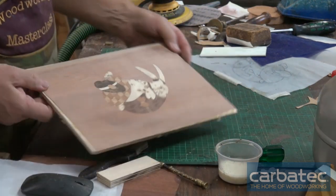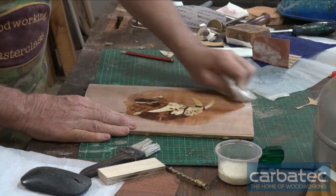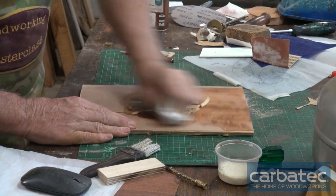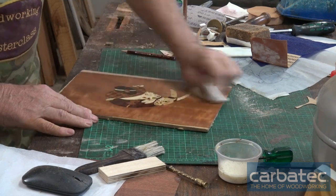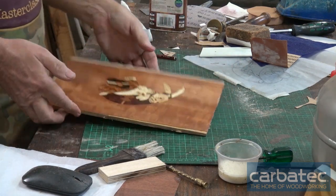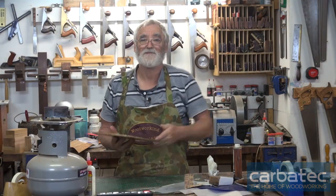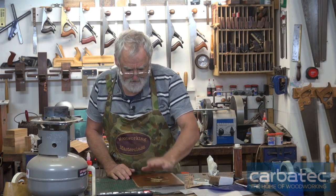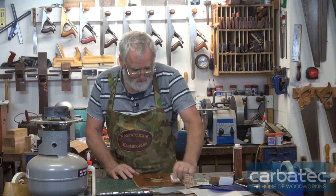And I reckon that's just about it. Be very careful if you're going to use an electric sander with veneer — normally I'll use the sanding block, but this is 180 grit and a very, very light touch. Now we'll just put a bit of oil on that and rub it in. Now he can go into storage. That linseed oil will keep it clean — if it gets any dirt on it, it'll only be on the surface and will wipe off quite easily. Down the track, we might even put that into a little box.